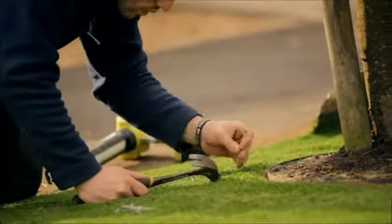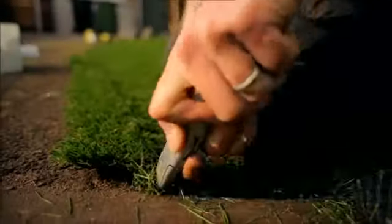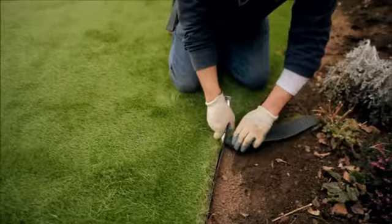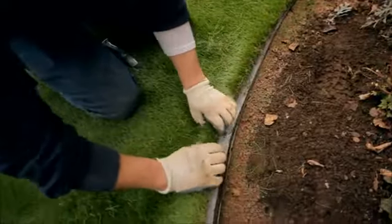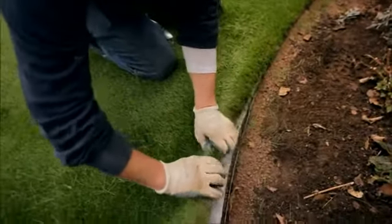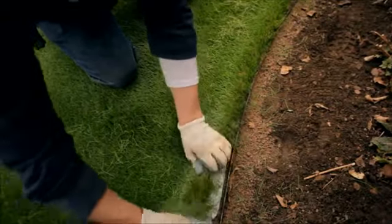Open the pile up to ensure the nails do not bury any tufts. Trim perimeter edges and nail at corners approximately every 75cm. Where the pile runs away from the perimeter edges, kink the carpet and brush the pile with your hand to encourage it to run into the edge.